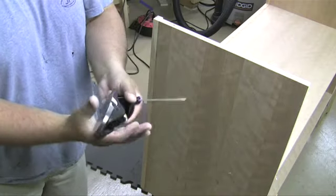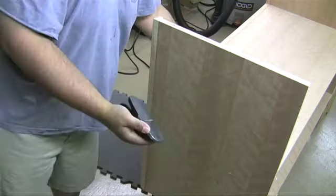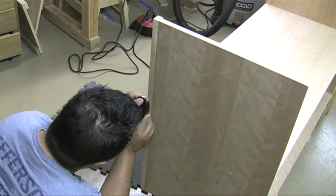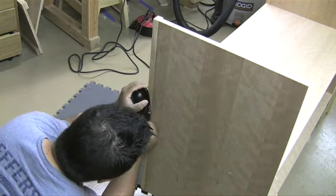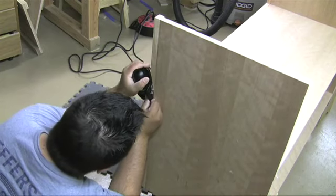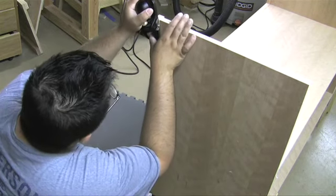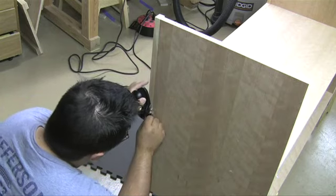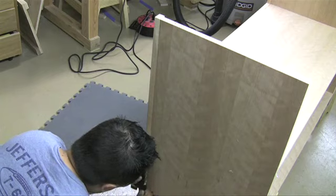On one side, once it gets into focus, I got this really nasty tear out — again it was because I didn't pay attention to grain direction. But a really neat tool that came out around this time was the Veritas small scraper plane, so I went ahead and picked one up. The neat thing with the scraper plane is it's an extremely great tool for dealing with grains that a regular hand plane would be horrible to work with — it tears them out. I put a slight camber into the blade itself using a screwdriver and start working in that area. Scrapers, whether a scraper plane or card scrapers, are fantastic for cleaning up tear out from tricky grains going in all different directions — or in my case where I simply didn't pay attention. If I had done a climbing cut I would have gotten a much better result.